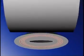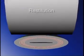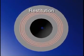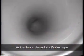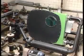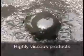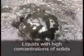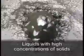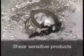After the shoe has passed, the hose returns to its original shape. This process is called restitution, and it produces an almost complete vacuum that draws the product into the hose. This approach makes a peristaltic pump ideally suited to pumping highly viscous products, liquids with high concentrations of solids, abrasive or highly corrosive and shear-sensitive products.